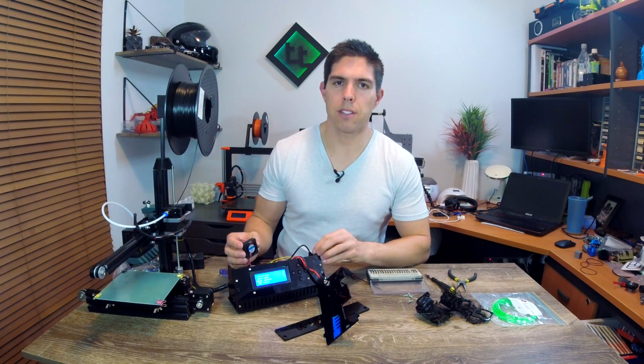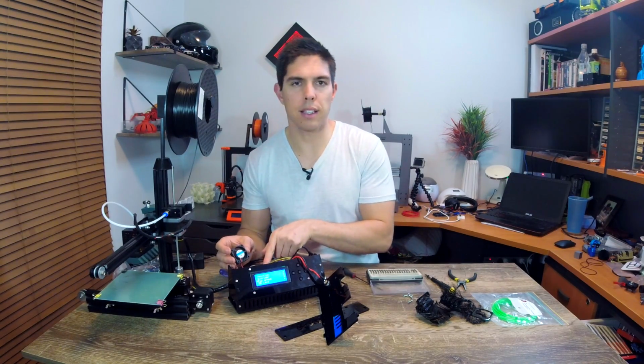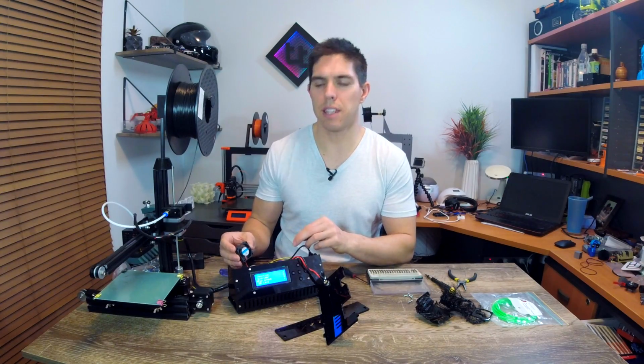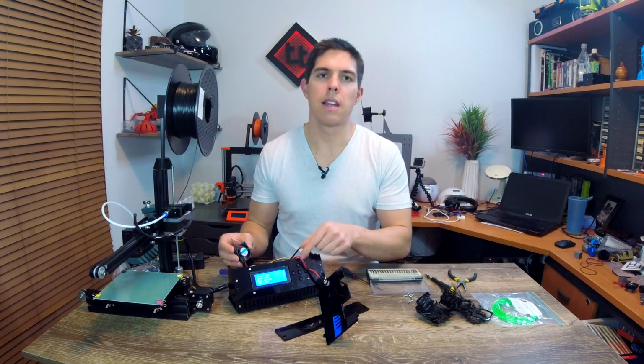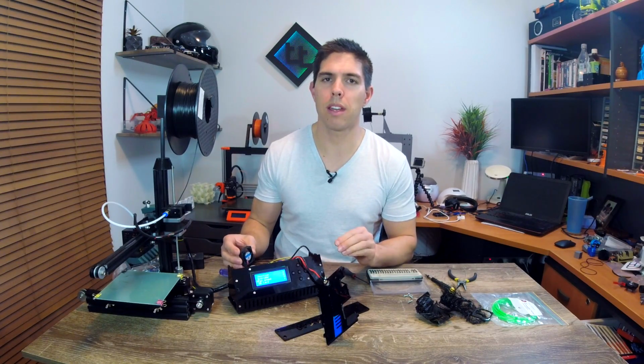Just paused my physical installation of the fan, and it is great news. There's one plug left called fan. I have a fan with the correct plug. The wires will need to be extended, but I plugged it in, went to the menu, manually set the fan on, and on it came. So that means everything is in the firmware like we expect, and this is going to be a really easy install.